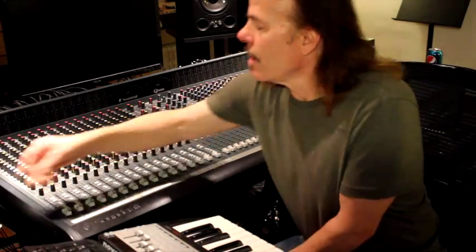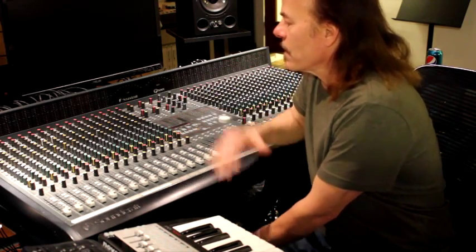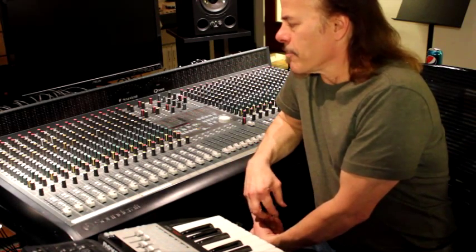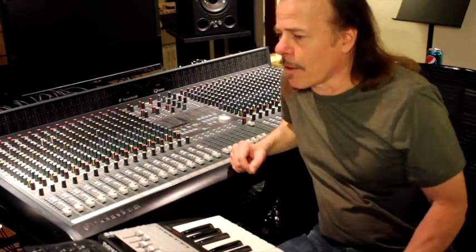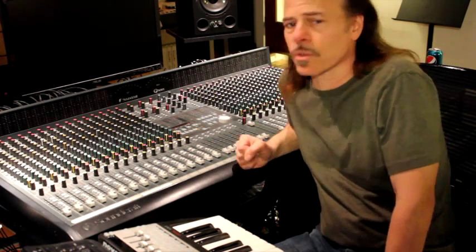Some of the things we deal with are mic pots — they typically are one of the most problematic things. This console has been serviced a couple of years ago. I actually went through and recapped the whole thing, not because the caps were unusable. This console is only about 18 years old, which is not real old for an analog console. But your caps will start to deteriorate after about 20 years, depending on how much heat is on the console. We used to have a Neve VR in a studio I worked at, and we recapped it every five years because they kept the console on all the time, which created an incredible amount of heat — the console heated the whole building in the wintertime.